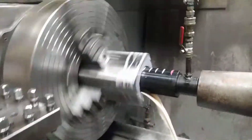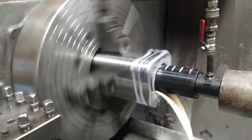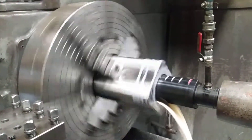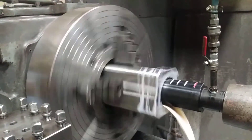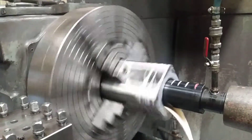Drilling a four inch hole 40 inches deep in 4140 hot roll steel. Parts start out round, we turn them, then mill flats on them so we can put them in vices and know the whole thing is flat, except around the radius on the corners.